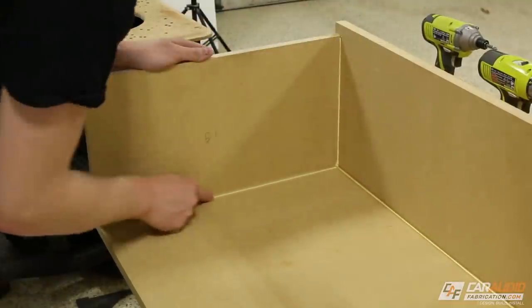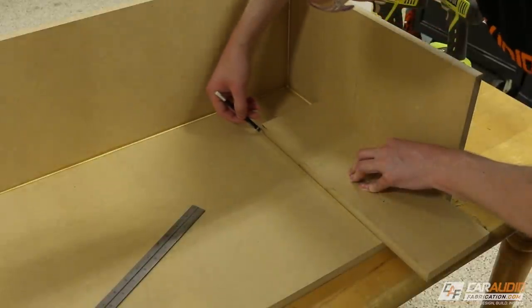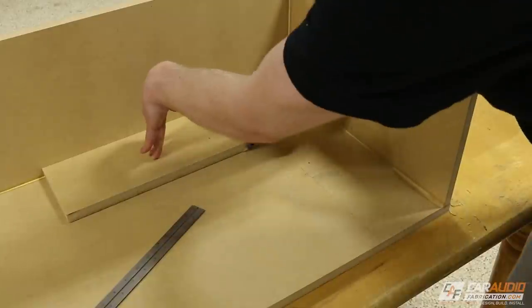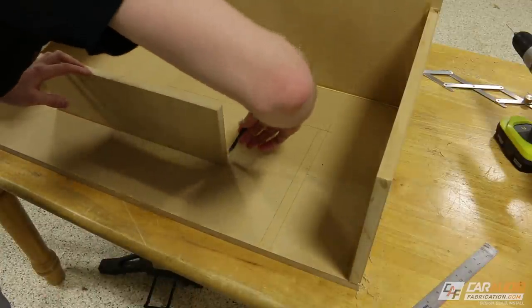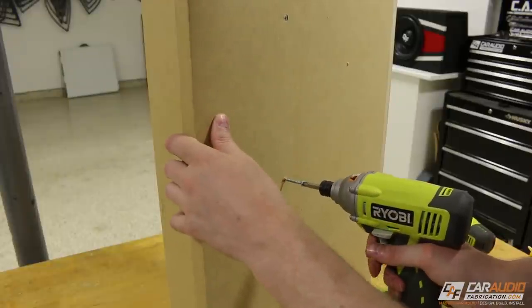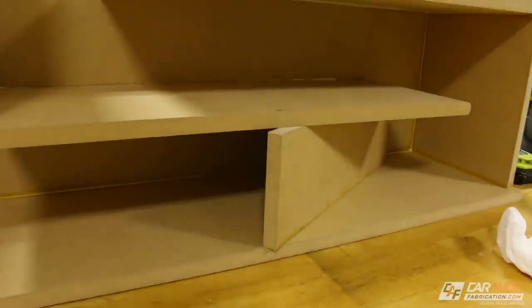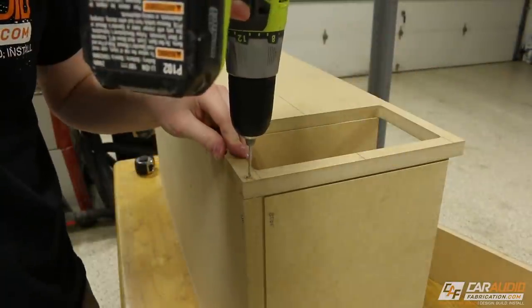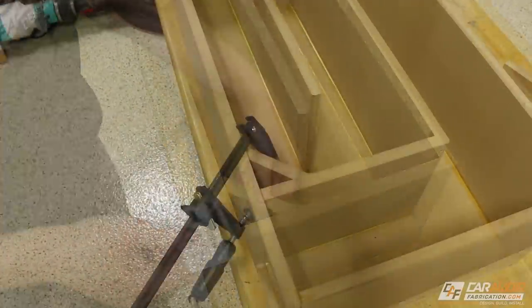With the side panel added it's time for more beads of glue. For the port geometry, draw out all the edges of where the port pieces will be using a scrap piece of wood cut to the exact width of the port — in my case five and a half inches. Stand it on its end to draw the thickness of the port walls. Since I can't see from the outside where to line up screws, I pre-drill holes from the inside, giving me simple holes to line up with once the port wall is placed. Follow up with a bead of glue, and use that scrap piece of wood again to aid in assembly of the remaining port walls. Next I add the front of the enclosure with glue and screws, and add the 45-degree corner pieces using glue and a clamp to hold them while the glue dries.